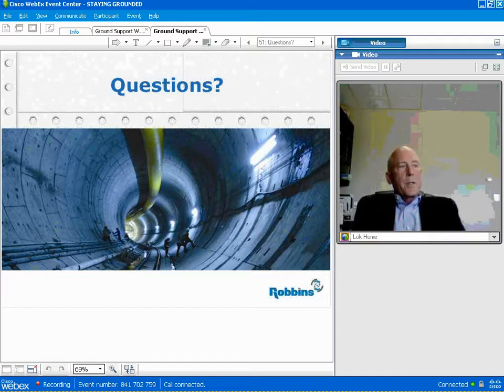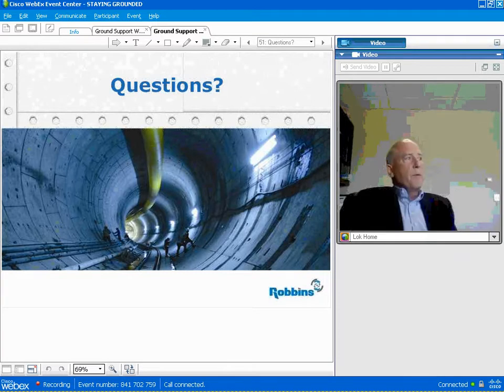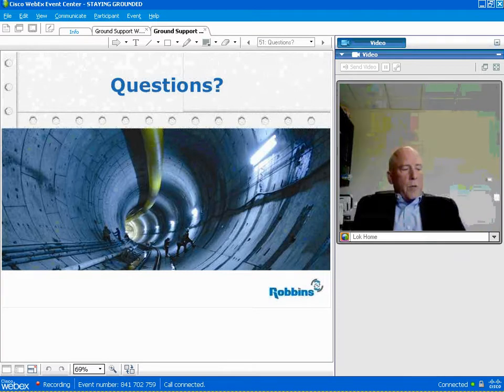So with all the current available grouts and good gels and grouting practices that we have today, if you can at least put a 1 meter probe hole pattern in front of you, you can set that up so you can bore through it. It may be timely, it costs a lot of time, but you can set it up so you can bore through just about any ground, even if it's merely running clay, you can make that solid.